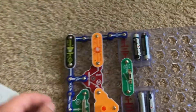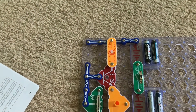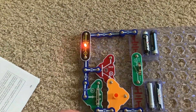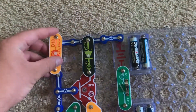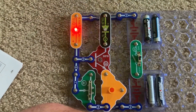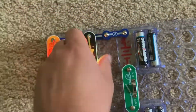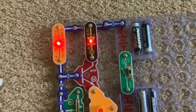If I was to remove the color LED, the bicolor LED will go off as well, but if I was to remove the bicolor LED, the color LED would stay on. You could also swap the locations of the LEDs, and now the bicolor LED is controlling the color LED via the Q2 transistor — if I removed it, the color LED will go out. So removing the color LED does not have an effect on the bicolor LED now.